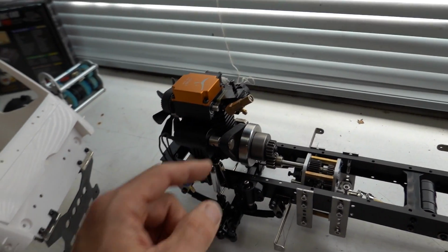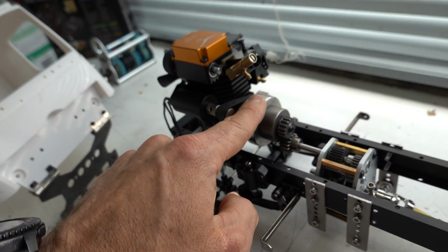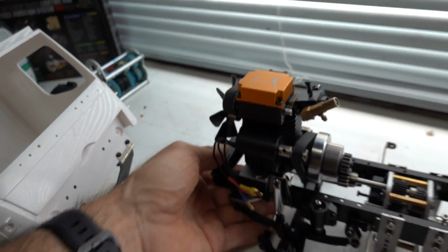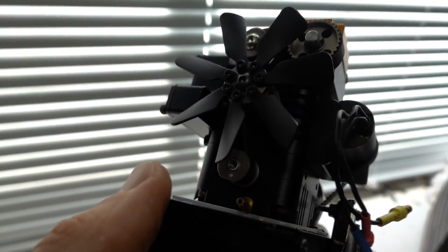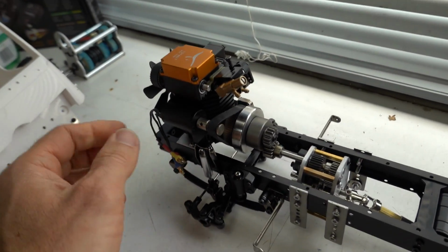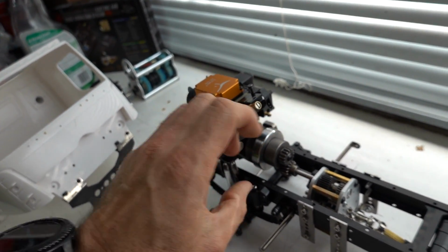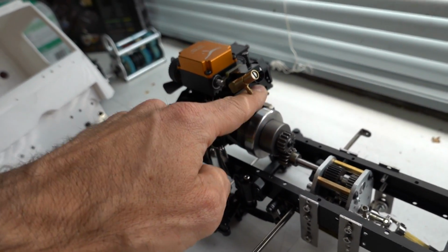Fun times. And I get a lot of people asking me, because Kevin Talbot couldn't get this flywheel off, the stock one. It's threaded. If you're watching Kevin, it's threaded. This pulley there at the front has two flats on it. You put a spanner on there, hold it with a spanner or multi-grips, and I think you turn it anti-clockwise. It's threaded, so you can't tap it off. The black one that you get stock is threaded.